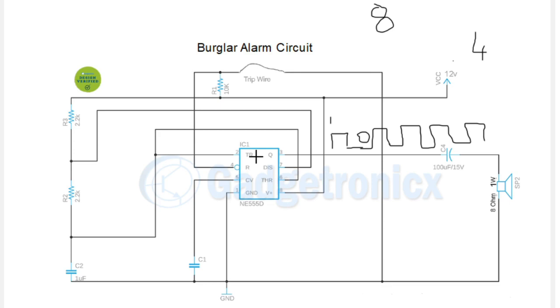There's one critical thing to the working of this circuit: the Reset pin. Even though the 555 timer is wired as an astable multivibrator, it will not work until the Reset pin is connected to VCC — that is, logic high. As per the datasheet, the Reset pin is an active-low pin, which means when you connect it to ground or logic low, the whole 555 timer ceases to work and gets reset.